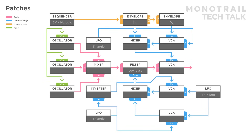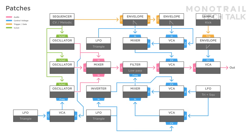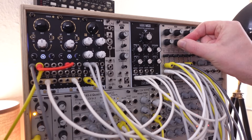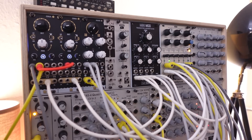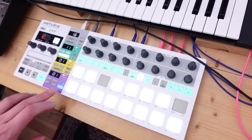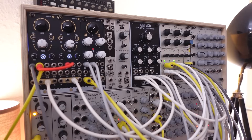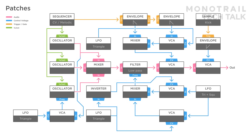Here a copy of the audio from one oscillator is sent through a VCA and on to modulate the FM input of another oscillator. Again an LFO is used to modulate the VCA. Another VCA is added at the end of the chain to add volume ducking with an inverse envelope triggered by a kick. There is nothing crazy in this patch, but the six VCAs, four LFOs and three envelopes all add a subtle amount of motion keeping the sound interesting for a longer time. Here's the same patch but with a different sequence, and a copy of the mixed envelopes is sent to modulate the filter as well.